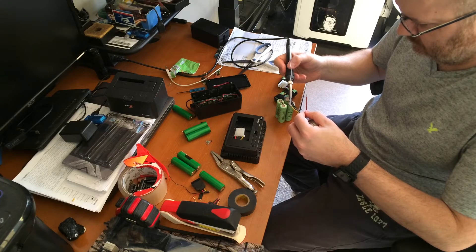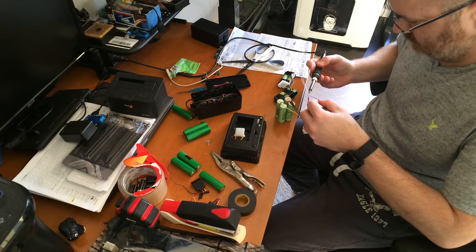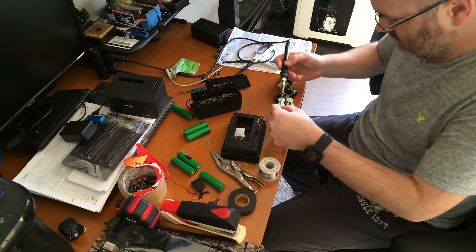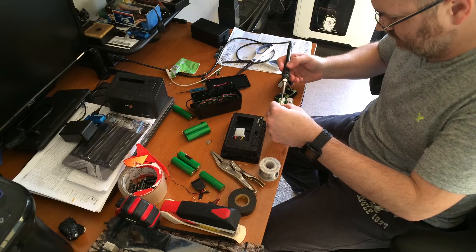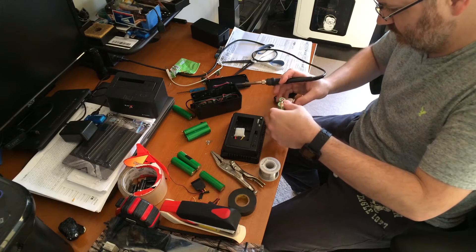Except in this third case, because the wires are so far apart, I need to solder them separately. Going back to the 18650 battery cutoffs — I know with lipos you're supposed to put cutoff devices so they never go below 2.7 volts per cell. As I said, I really don't care if these batteries die; I've had them in my drawer for a while and I'll just take them out and recharge them.